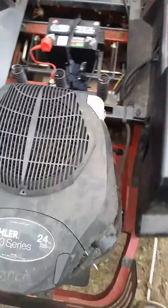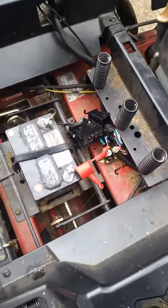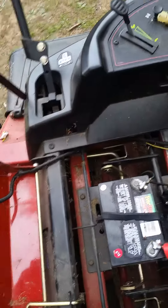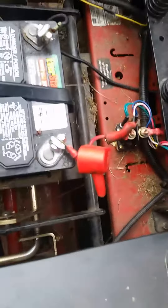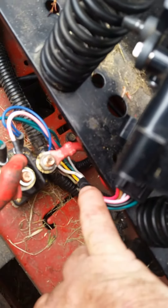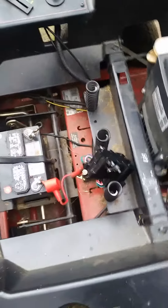This unit is sitting in a storage area because it had failed. Ohm out that switch, ohm out this switch — if they're both good, your ignition switch is providing power down here. You've got power — check that red wire right there in that setup. Pick anything, go to ground with your meter, and see if 12 volts are going to it. If 12 volts go to that wire and this system isn't working, you're done — video over.